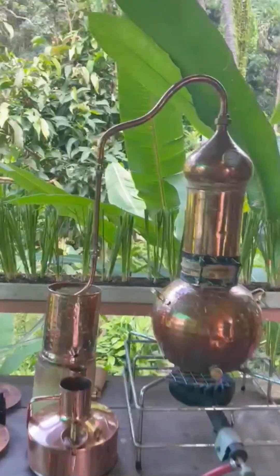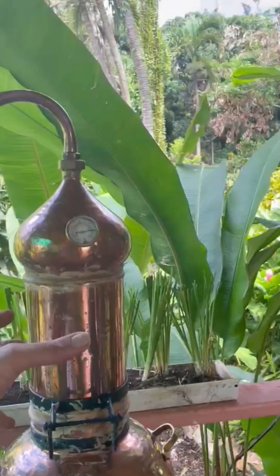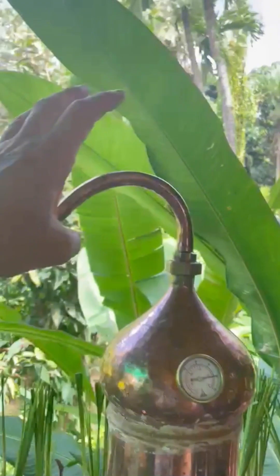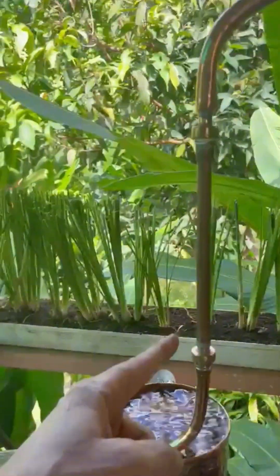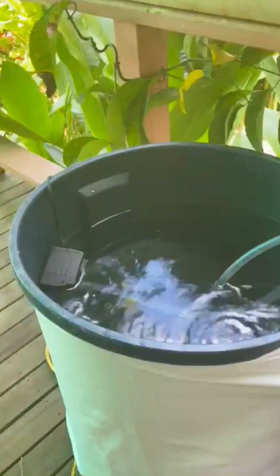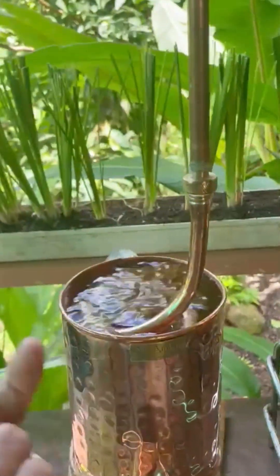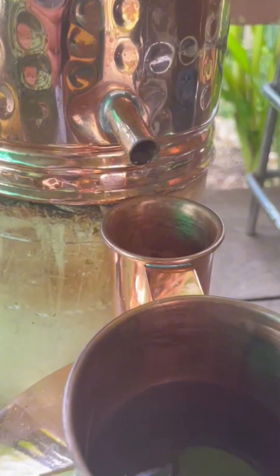It's all set up and good to go. Our water is boiling — coming up, the vetiver is in the column right here in this area. It comes up through the head and this is our condenser. We are constantly circulating a big barrel of nice cold water through this pot, so the condenser coil gets cooled off and the steam turns into liquid — a mixture of hydrosol and essential oil.